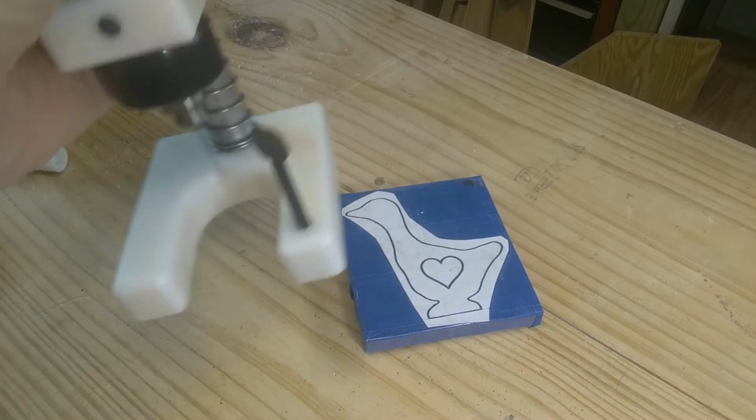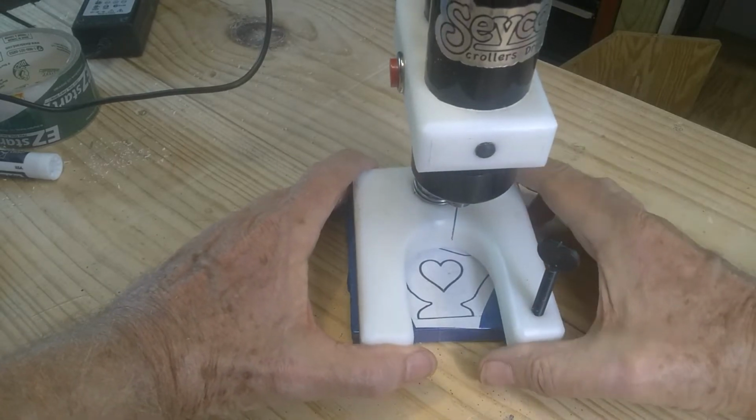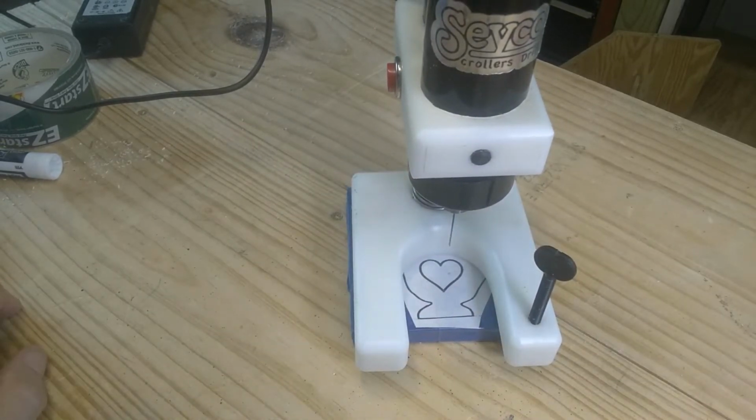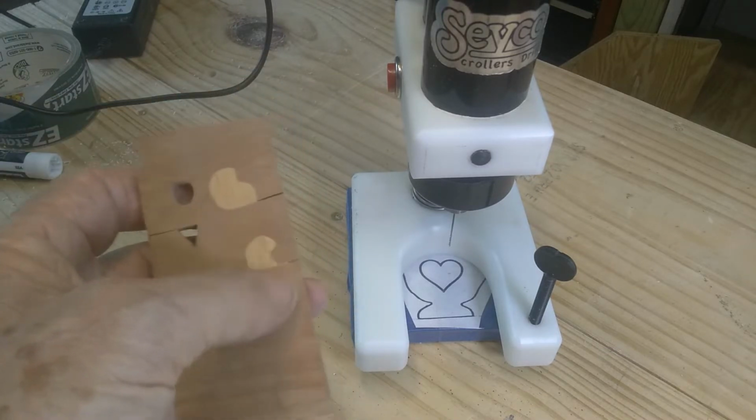But I've got a very small drill bit on this drill because this one you can't hide the drill hole easily if it's too big. I make as small a hole as I can, and I'm using a number 3 blade. I wouldn't use anything larger. I said most of your work you can do with a 5. This is one of those I wouldn't use a 5. Thicker wood you probably get away with that, but it's 1/4 inch wood, and the angle I'm using, I'm just going to use a 3, and that works well for me. That's what I've already got the saw set. I've already tested it and made this little piece inlay right there.